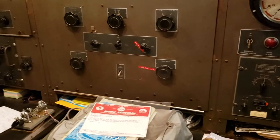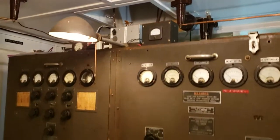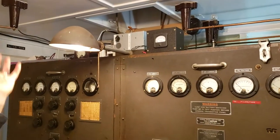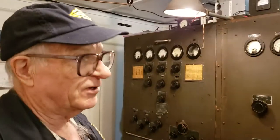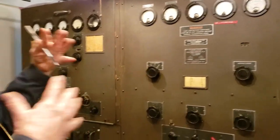35-45, what did you say? Yes. I saw that little neon bulb up there flashing while you were transmitting. Yes. Well, and notice it's not connected to anything. It's just connected, so it's like currents going out in the electric field. It glows even brighter on 500 kc because there's much higher voltage, because the antenna is a little shorter electrically.